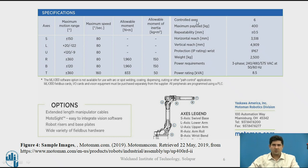In this particular case, this robot has six control axes — three being the first three axes and three being the wrist. Maximum payload is 400 kg, so this is a very heavy payload category robot. Repeatability is a spectacular plus or minus 0.5 mm, which is extremely good for a robot of this size and payload. It has vertical and horizontal reaches, protection ratings, and weighs more than two tons. It is driven by a three-phase power supply, indicating an AC electric drive, which is the most common drive for electric robots. High joint rotation speeds are present, though less than lower-payload robots.